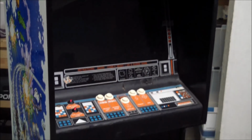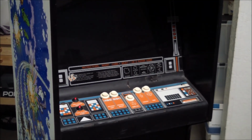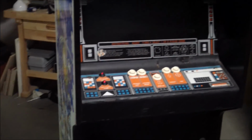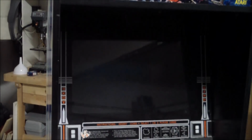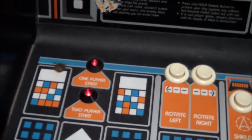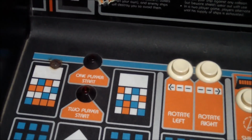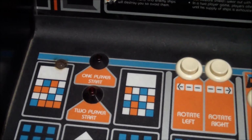Nothing on the screen. It keeps repeating that, playing the little welcome song. Actually, what I think that is, it's telling me there's something wrong with the board. It's the self-diagnostics communicating with me. Nothing on the screen. But you'll notice that the start game lights are blinking. So the CPU is good. I mean, it's doing something. I can start a game probably. But the monitor is blank.